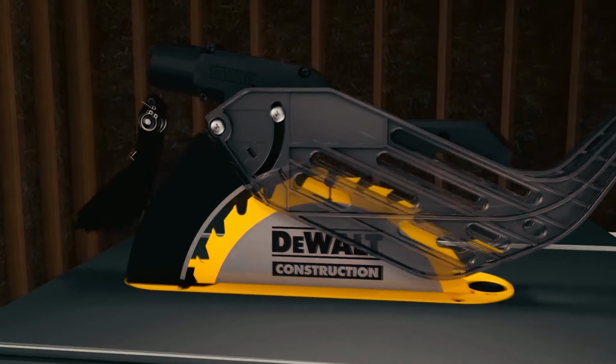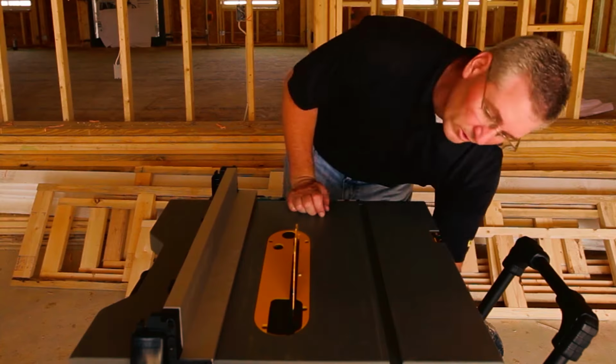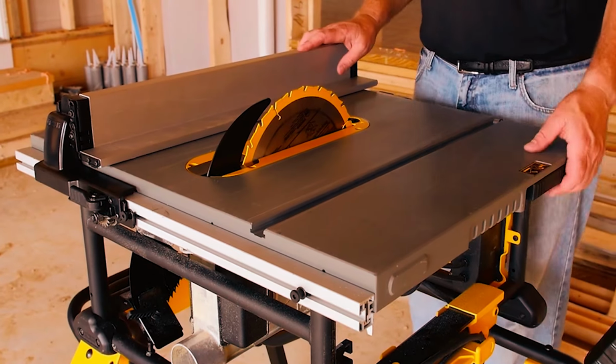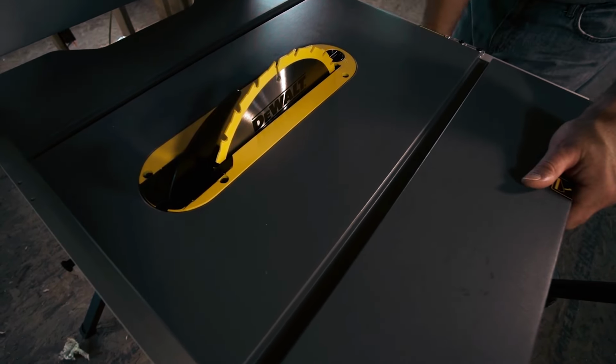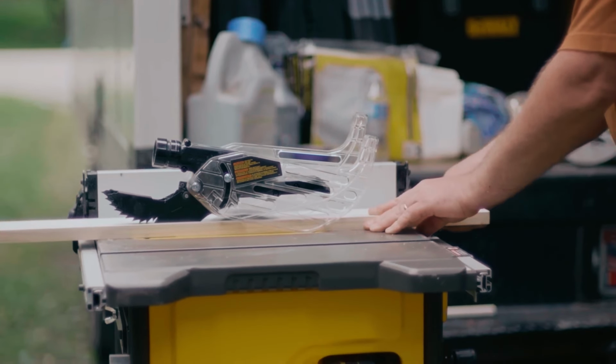Standing in the kickback zone. The kickback zone, located behind the blade, is one of the most dangerous areas when operating a table saw. Standing directly in this zone puts the operator at high risk of injury if kickback occurs. Woodworkers should position themselves to the side of the blade and slightly behind the workpiece to minimize the risk. This simple adjustment can significantly enhance safety in the workshop.